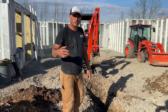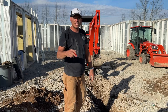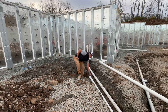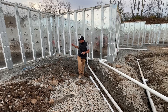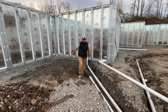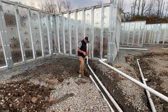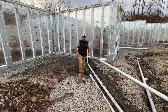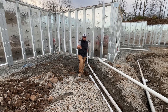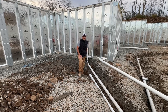That's it for the plumbing part one. Maybe we'll finish the rough-in tomorrow. Good morning everybody — it's another day of plumbing, we're going to finish this up today. This next piece is going to be for the bathroom for future use. I'm having a tough time figuring out how to dig this out because I can't get the mini excavator in here. I might have to close this up temporarily, leave this joint exposed, then run the mini excavator over. The rest is just a home run straight through — going up with a Y. I'll turn on the time lapse.